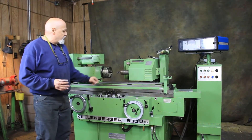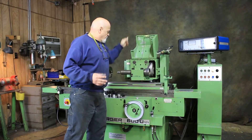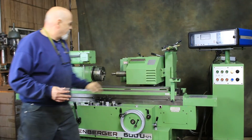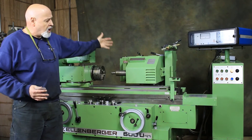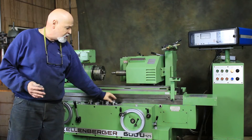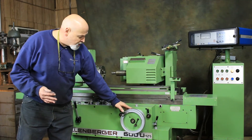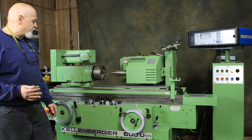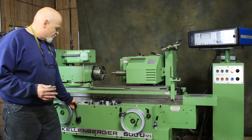One of the things that changes when you're doing internal grinding — you can see in here the spindle with its flat rubber belt — is that in internal grinding mode, you no longer want the slide to go back rapidly. You have to put it in internal mode. There's a mode selector switch here as a safety so that the hand wheel will feed down and retract back to the starting position, but the slide stays fixed.